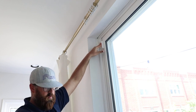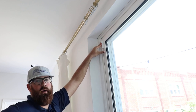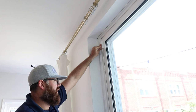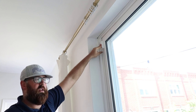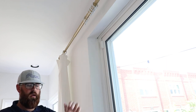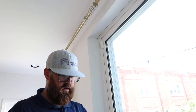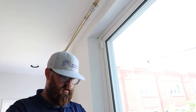Just hold the sensor on for about 30 seconds — count down, one, two, three... you're going to hold this down until it sticks in place. If it's hot outside it's going to stick pretty easily. If it's cold, and it's a window frame, warm it up a little bit with a hair dryer — that's just going to make it stick a little bit better. Now I've got this adhesive and I'm going to adhere it to the back of the magnet sensor piece.